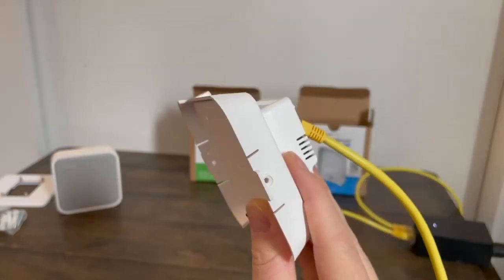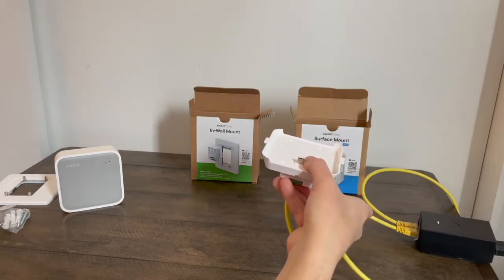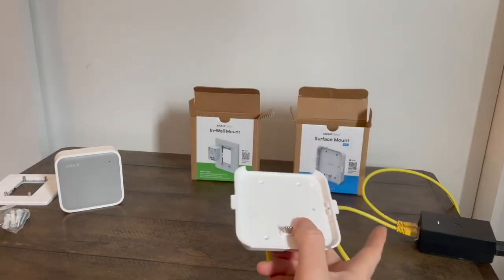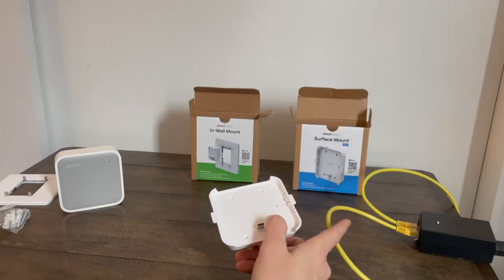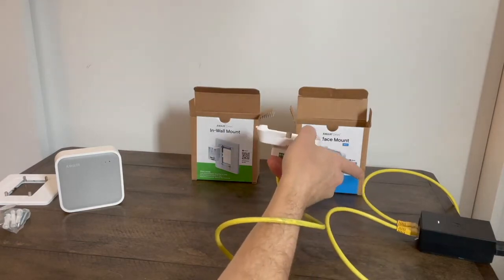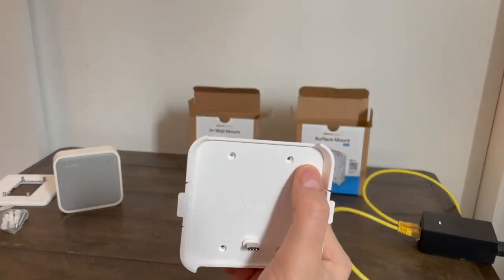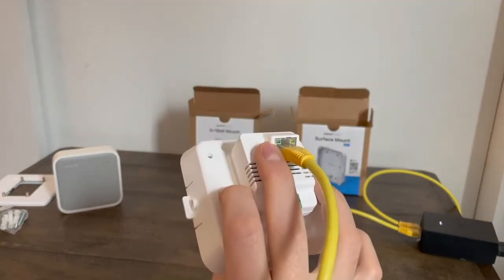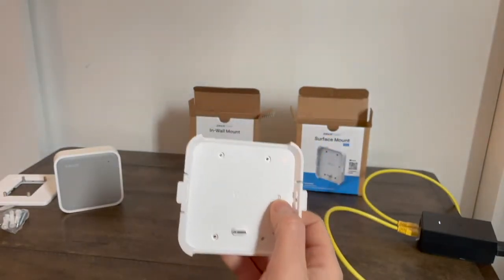On the right-hand side back here, you can see I have this line coming out from the PoE side of a PoE injector. This may also be a switch or something like that on the network — but for these purposes I have an injector, with the data side going back to the computer. The status LED on the front will be lit up, but you don't see anything on the RJ45 status light quite yet. I'm going to next switch the mode switch to ethernet.